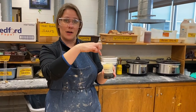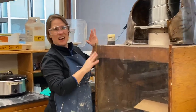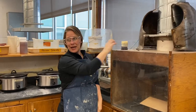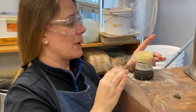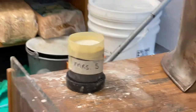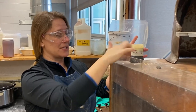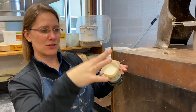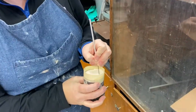Once the investment is poured into the flask, I move it over by the vent so nobody will touch it and other classroom activities can go on. I have tape with my name on it. Eventually I'll take a wax tool and carve my name into the top of the investment. Right now the piece is still liquid — if I shake it, it moves — but it should solidify in a little while. Then I'll carve my initials and calculated weight into the top.